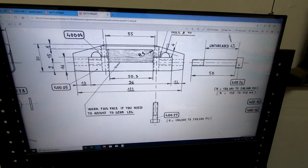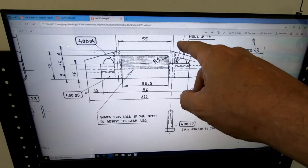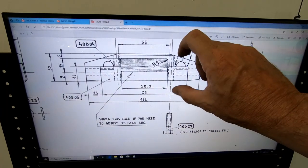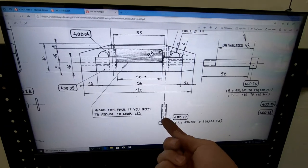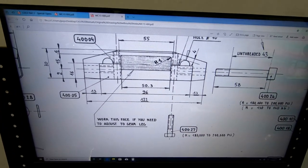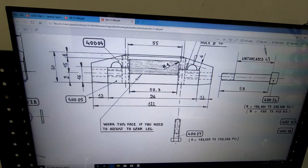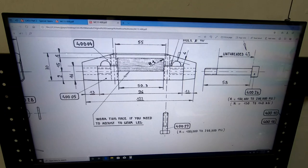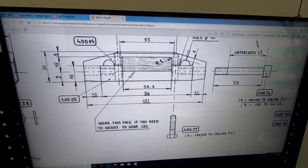would ever break. Now, this bolt here is mostly in a tension situation. It's not in a shearing situation. So again, you would still think that this bolt would rip out of these threads, and these threads would give loose on this aluminum fitting long before the bolt would break. So I'm not exactly sure why the designer is specifying such a high tensile strength bolt here.